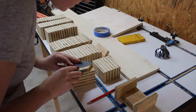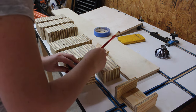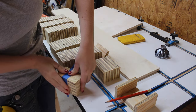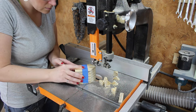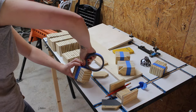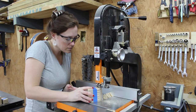The side pieces have two 45-degree angle cuts on them. I used an old piece to trace the lines out, but you could just find the midpoint of the piece and use a speed square to draw the 45-degree angles. I grabbed about six pieces and taped them all together, then took them over to the bandsaw and cut them out. This way I could undo them and make new bundles of about six pieces with a template piece taped onto the front.